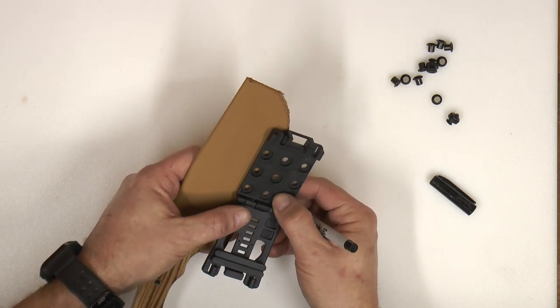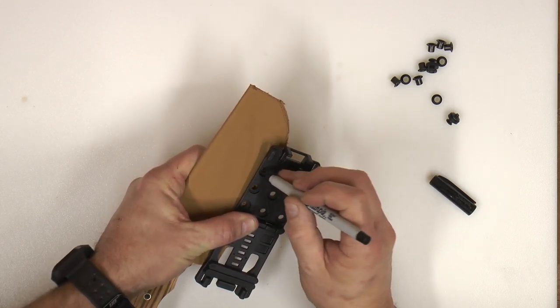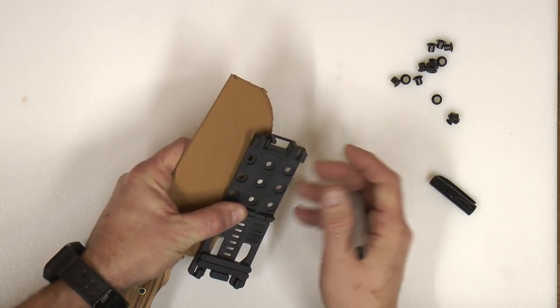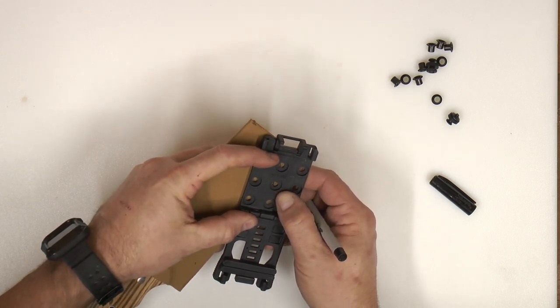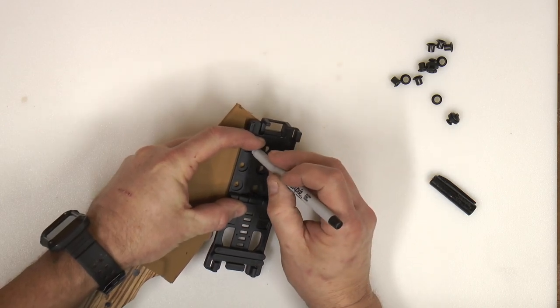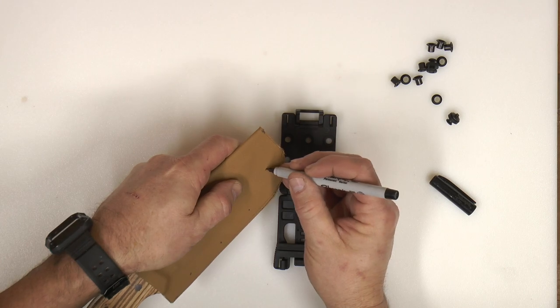Now, since we're using a Tek-Lok, the other beauty about the Tek-Lok, obviously those holes are going to stay the same distance apart the whole time. So if you don't want to use a tape measure to measure the distance between your holes, you can just use that Tek-Lok, and that way each of your holes are evenly spaced, or at least very closely evenly spaced.